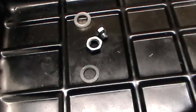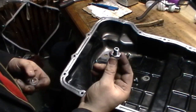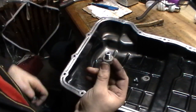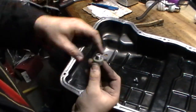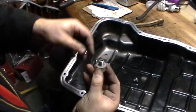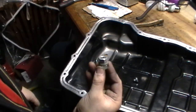It will come up through like this with a little bit of threading. Once you've got the hole drilled the rest is fairly simple — it's just bolting the thing together. First you have the main bolt on the outside of the pan, then you put a washer and it goes through the hole. Then on the inside of the pan you take the second washer so these two plastic washers are sandwiching the actual pan itself. Then you just tighten down the bolt on the inside.